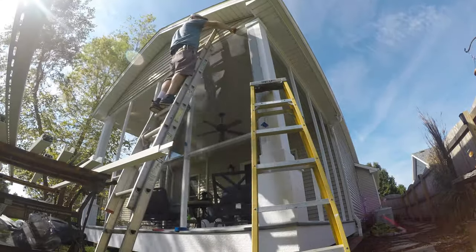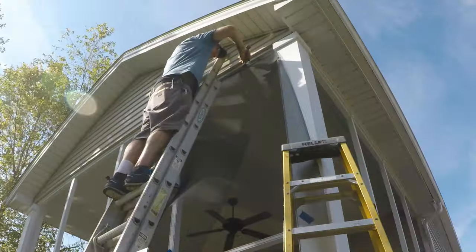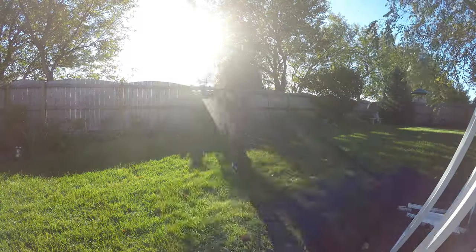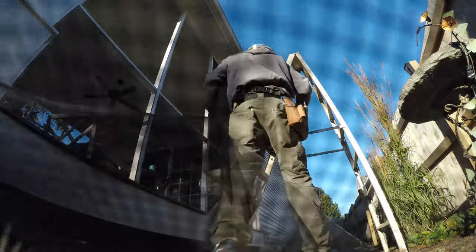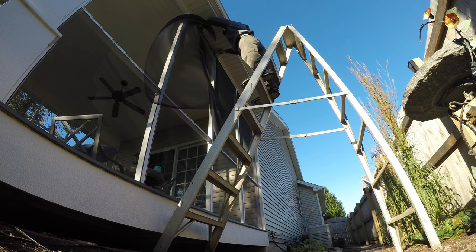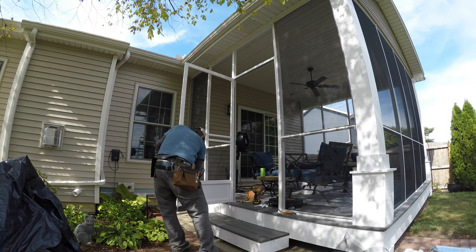Be careful when making your grooves or the screen will rip. There are a lot of kinds of screen out there — copper, plastic, PVC, aluminum, steel. This aluminum stuff is coated, you can cut it with scissors, but it's also pretty rigid and strong. For technique, there are a lot of videos out there, but take it slow and keep your roller on the outside and you should be okay.